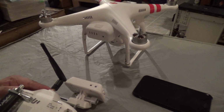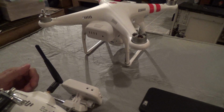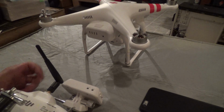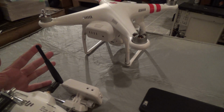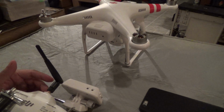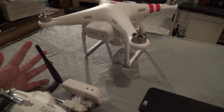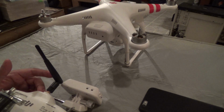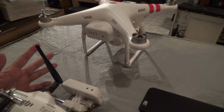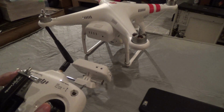So now, moving forward, let's say you're flying, you have those bits out of the way, and you have a decent signal on your FPV feed, but suddenly it drops. But everything else is good. You know that you're flying high enough, or if you're not sure, you could always gain some altitude, and that will sometimes help you. Or sometimes you might be flying through a patch of interference where just pushing through that interference a little bit further will make your signal pop back.